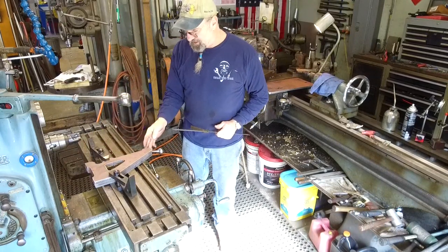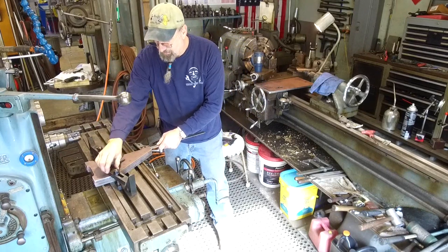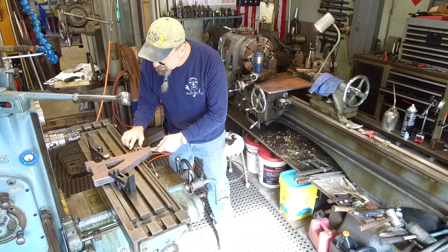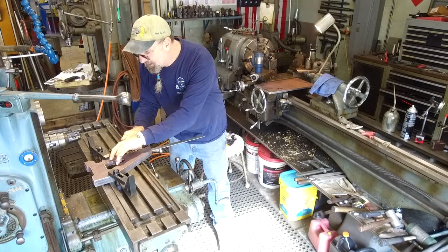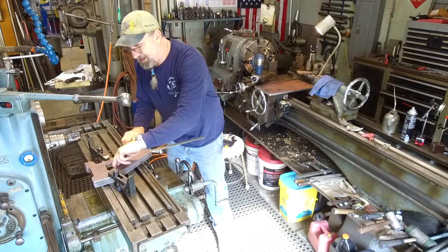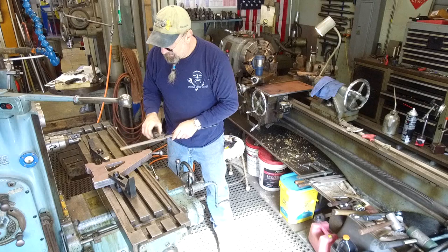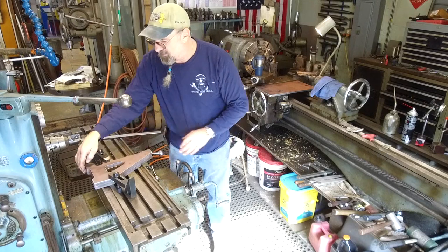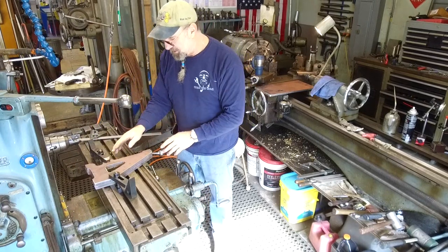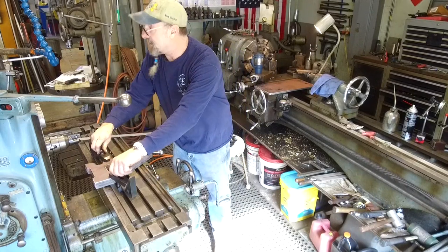We're setting up off of these two surfaces here and the table. This is still loosely clamped both sides. I'm going to square the bottom plate, which I've got this one setting nice. The webs, everything feels really good. I'm not going to try to line up the feet or anything else like that. I'm just going to lay it down, and I know that this is going to be square, and we're going to tighten this down now.